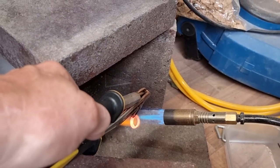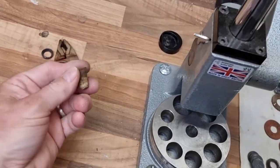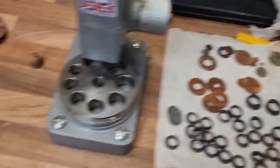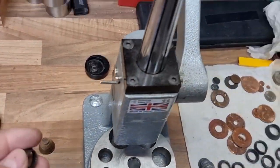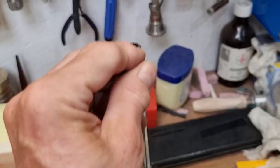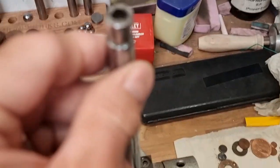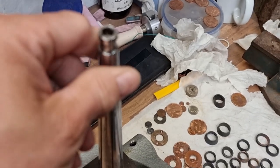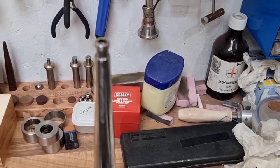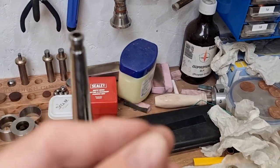I'm not sure I filmed that last bit when I did the little cone — I probably didn't. Sorry about that. Right, safety first — turn the flame off. This is where we start on the Durston ring stretcher, which I'll also need two hands for: stretching it to make more of a ring shape and making the area in the middle bigger. This is a Durston ring stretcher used by jewelers. The center comes up and pushes the splines apart, opening the ring.